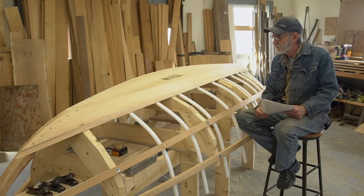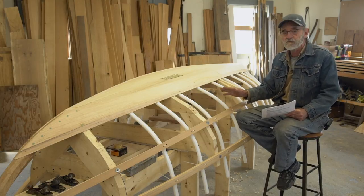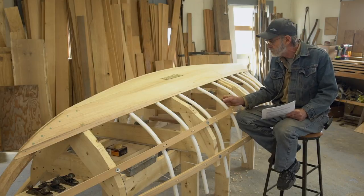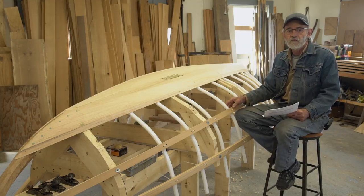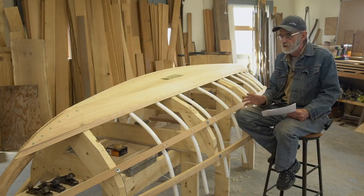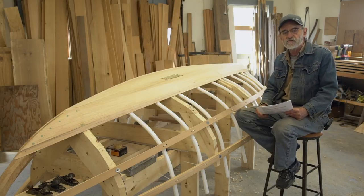It's pretty interesting material. It's incredibly strong and yet flexible. I've used this plastic to frame some very, very large boats. I did the whole bottom of a 60-foot Trumpy power yacht with 2x2 plastic. And I think it would have been almost impossible for me to have reframed that boat with wood. It would have been awfully difficult. The plastic made it easy. The boat is serviceable today. It's never had any problems whatsoever.